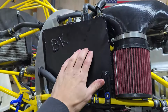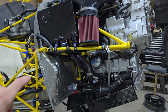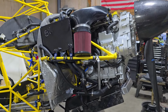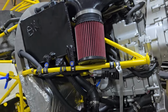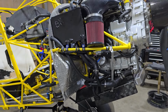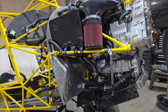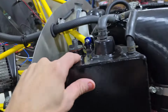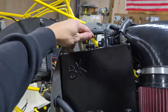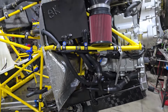Okay, you might notice that the oil tank is now different. I had the original Yamaha Apex tank in here originally, and they've been known to leak. They're very, very thin and they're kind of stamped together. It started leaking before I even flew this thing yet. It had a little leak out of one of the seams in the factory, so I was like, well, guess I'm building a custom tank. You can buy oil tanks off a few guys that are making stuff, but for this application, I needed a very specific shape to fit in the space I had. I was able to enlarge the capacity and use some of the stock fittings and just weld them onto my custom tank. Drains there, and it seems to work good. Even got the stock level sensor in there. And I got some footage and some pictures of how I built that with the baffles that I'll show now.